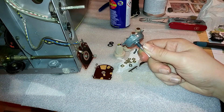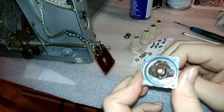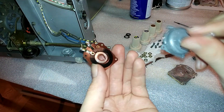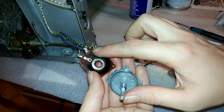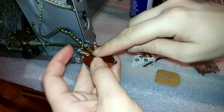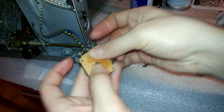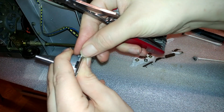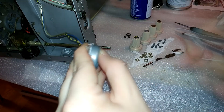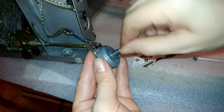Now I have to figure out how to put this thing back together — here comes the fun part. The potentiometer can only turn so much, and in this case we have it in the center position, so we have to get this side facing down. That means our logo is going to face toward the bottom side of the potentiometer. Since the whole thing is spring-loaded, that's a bit tricky to do. Then we just have to push those clips back and clamp them in place. And there we go — our potentiometer has been fixed.